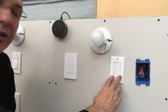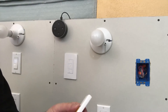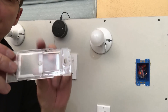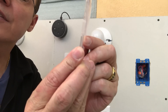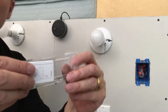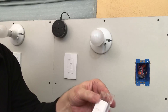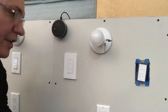Since we already had a three-way switch box, we use the Pico wall plate bracket. On the back of the Pico, the little plate pops right out — we won't be using the double-back tape. The bracket has a small piece at the bottom that slides into the same slot where the tape plate was. Slide it in and push it down nicely, then snap the Pico remote into the bracket with the correct orientation.